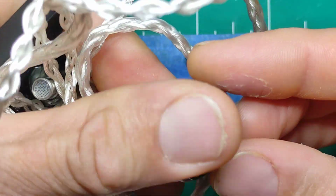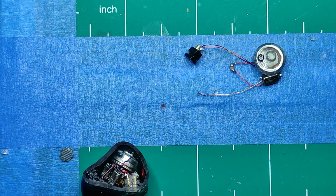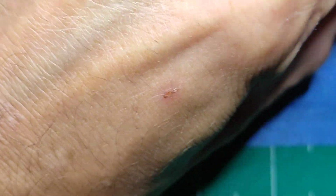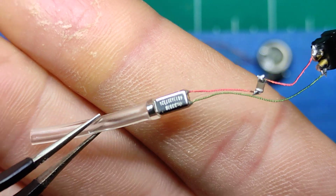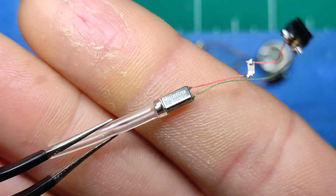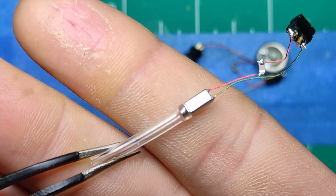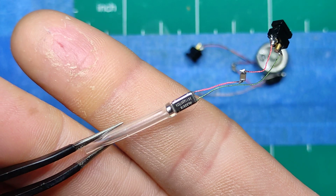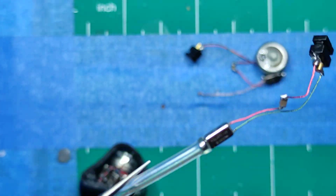When you graph them, they go all the way off the chart, but when you listen to them, they just don't sound good. So lesson of the day: if you're an IEM builder or a DIYer, 33518 or better. Don't use anything else. Don't use E-Audio. I mean, well, you can use E-Audio, but don't use Belsing. Whatever you do, don't use Belsing. You can use them for mids, you can use them for bass. You can use them for full range, but do not use any cheaper BA brand for treble. Just go straight to the best, which is Knowles or Sonion.